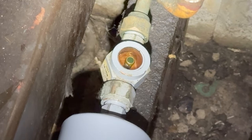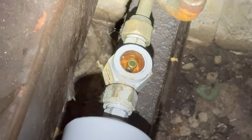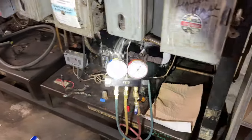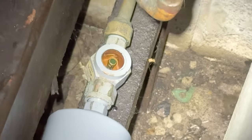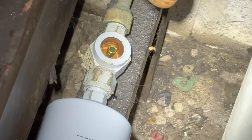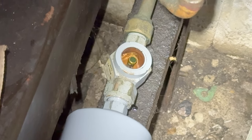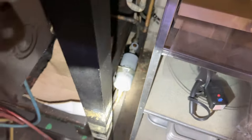We're about two pounds into this jug — we had nine before that and two the day before, so we're at about 13 pounds total. These have some pretty good-sized receivers underneath here, and this one is no exception. Back in the day, refrigerant was a couple bucks a pound; it wasn't a big deal — it was R12 back then, even. So they are just hungry hippos. I'm not picking up any leaks — I had a little something towards the front, but that could have been a false alarm. The refrigerant flow is kind of slow, but I don't feel anything on my dryer like it's restricted.